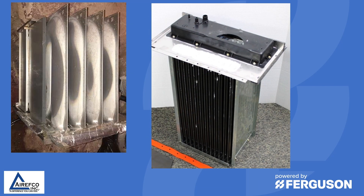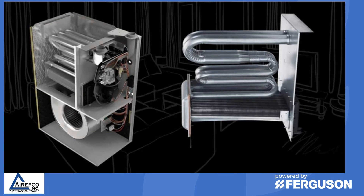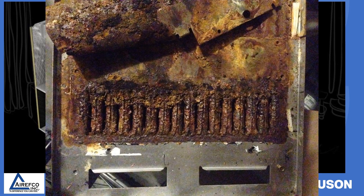Here you see the heat exchangers of a modern gas furnace. On the left you see the primary cells that should be examined for holes and cracks. On the right you see the secondary heat exchanger, which you would find in a 90% furnace to extract more heat out of the air as it passes across the heat exchanger. These heat exchangers need to be examined periodically — definitely before each heating season — for any cracks or holes. This is a totally corroded heat exchanger, and if you find something like this, you definitely need to replace it.